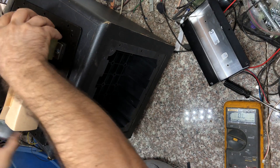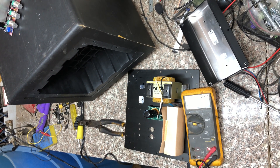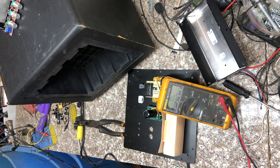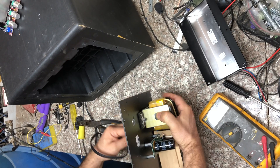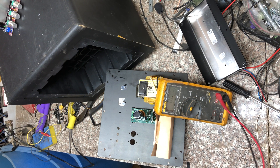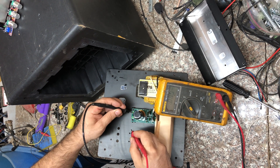This is going to simplify things a lot, but I'll still need a pre-amplifier. Some videos show assembling an amplifier and just connecting a phone and getting sound, but those amplifiers can give you a lot more if you add a pre-amplifier. This board is 50 plus 50 watts for left and right speakers and 100 watts for the subwoofer. I'm going to fix that by installing a small mixer I fixed in another video - I'll leave the link. I'm going to test with and without the mixer so you can hear the difference.